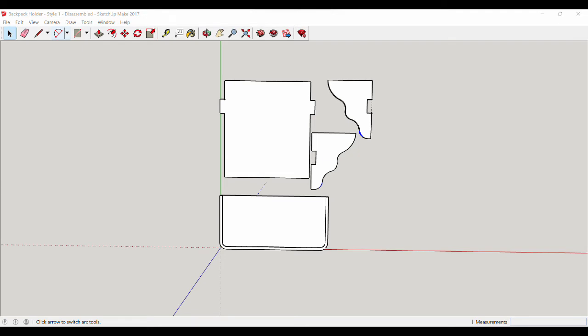Once you've got it installed, I'll go back to the design I've got and basically disassemble it. All the parts are there. It looks great. That's what I need to see. But in order to make the outlines for the toolpaths, I need to have it all disassembled. So I save this as a separate file, just whatever design I've got disassembled.